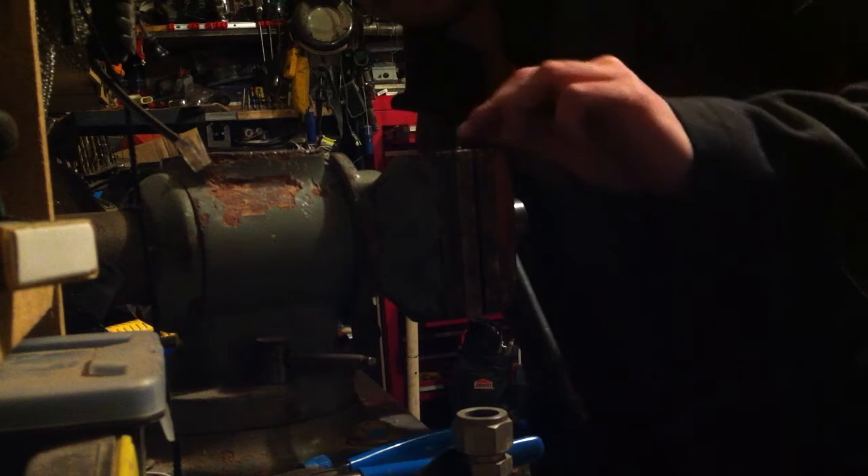We're building a spring for this post here. It's going to be wrapped around — I'll show you. That post is from a spring latch for a soprano saxophone, a Selmer Super Action 80. It's a pretty standard latch, and the spring part was broken on it, so I'm making a new one out of some spring steel I got a long time ago, which I intended for my saxophones, but they kind of suck. So I'm finding a use for this, and what I'm doing is coiling it around this.